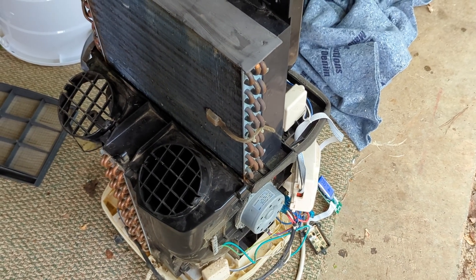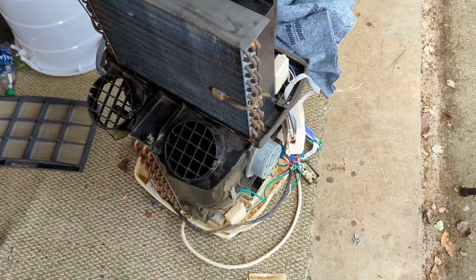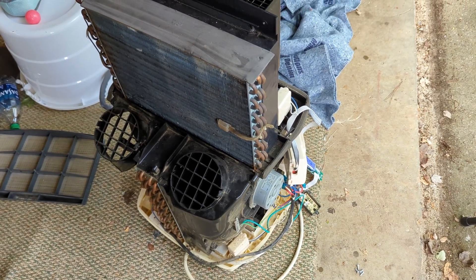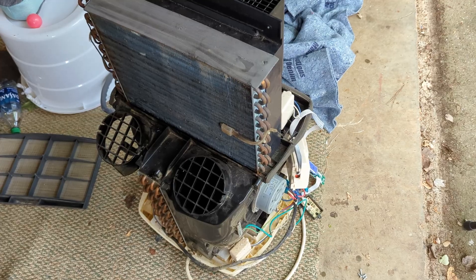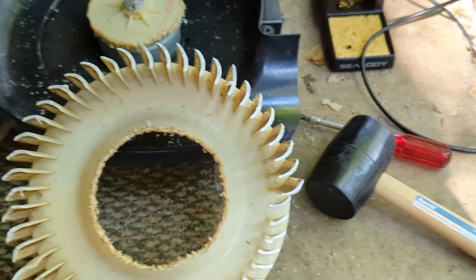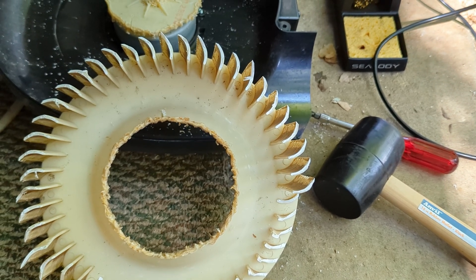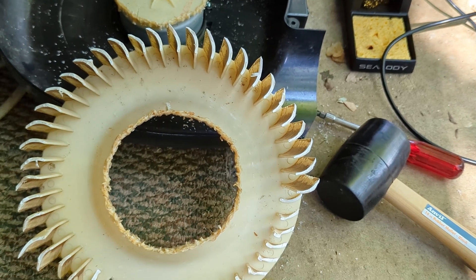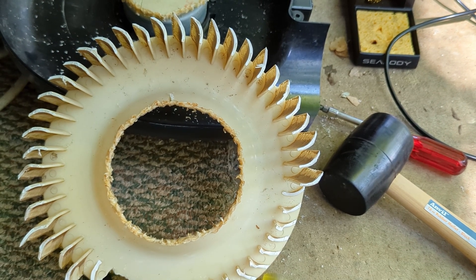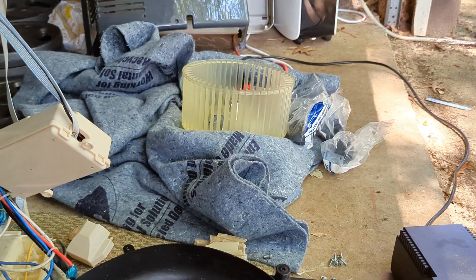As a last-ditch effort, I just cut the blades in half because I couldn't separate the fan for now. I feel like the motor is good — I just need to get a new fan assembly. That's about 40 bucks, and hopefully that'll solve it. Sometimes it calls for extreme measures. I know that my soldering iron is not the greatest tool for this, but I don't really have any other hot element. I've got the old fan at least cut off. Now I just need to remove the bolt from the motor, and then I should be able to put the new fan assembly on top.